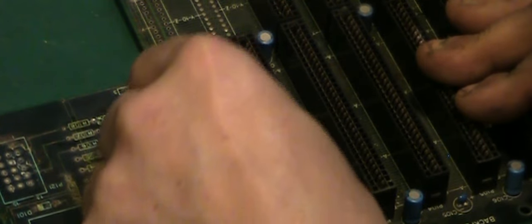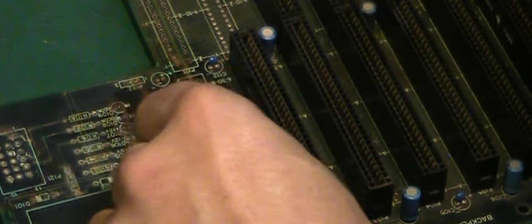Right, what I'll do, I will carry on cleaning round like this, because you can see what I'm doing. And that's the first Q-tip there. We'll move on to a new one. And I will come back as soon as I've got the majority of this corrosion off. Like I said, as you can see, it is just a case of work the vinegar in and just keep working at it, and it does start coming off the board. Right there, you can actually see the silkscreen on the board start coming back through where it had basically disappeared by the amount of corrosion on it. Be super careful around there where there's that lifted trace. Right, I will be back as soon as I've got some more of this off, so back very shortly.